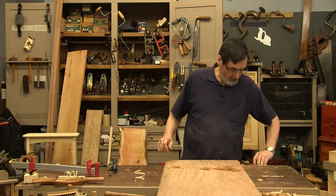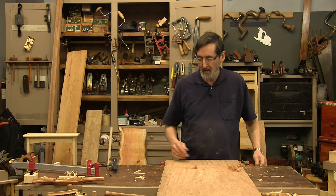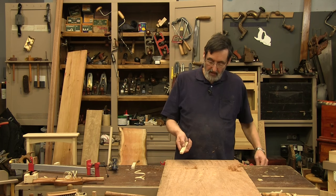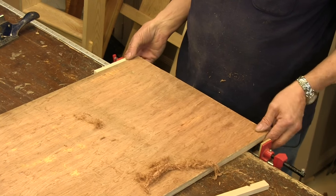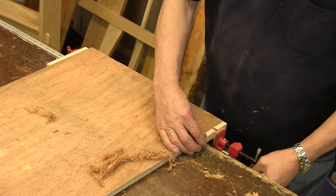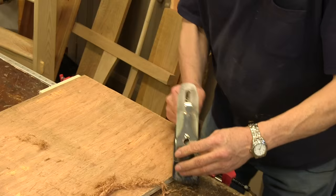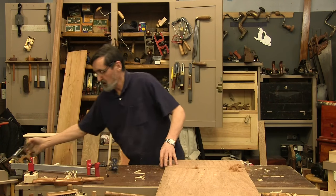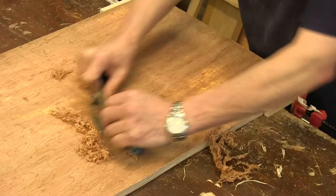This is very nice and solid. If I'm concerned about the edge of my table — say it's a softwood like pine — I can open up the vise and use a shim. I have a saw-cut piece on one side, cut on the band saw to the right width. I anchor this in here, which really anchors it nicely. If it's sticking up slightly proud, I can just take my plane and plane it down to the surface so it's not in my way. Then I can take my scraper without worrying about damaging the edges of my workpiece.